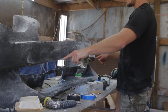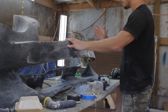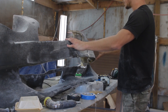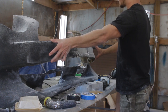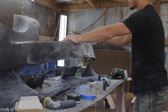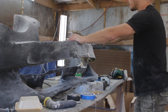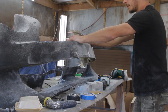Right now, the bottom half is level enough. It's close enough that you really can't see with your eyes, within like a 16th of an inch. The top is not. The top slopes upward on this side, which means that over here you've got like a 5-inch bar. Over here it's like a 4-inch bar, 4 3/8. This is like 5. I can't just cut and drop it because for some reason these headlight buckets are still the same height. If I drop it, this one will be noticeably higher, and I think it's just going to look crooked again. So I'm not really sure.